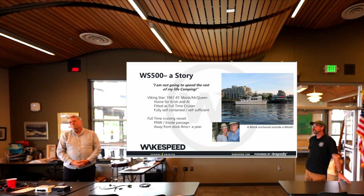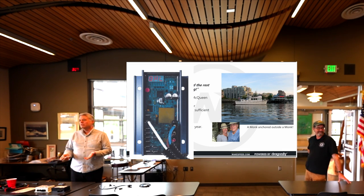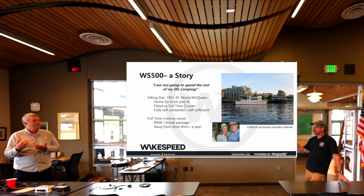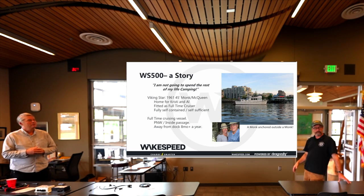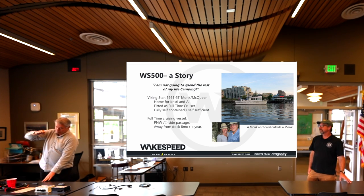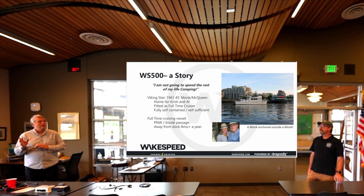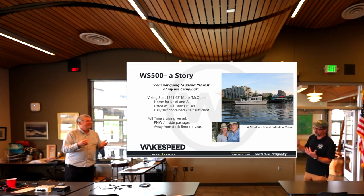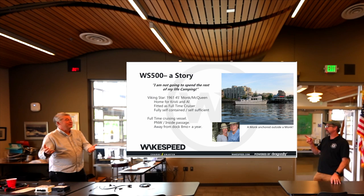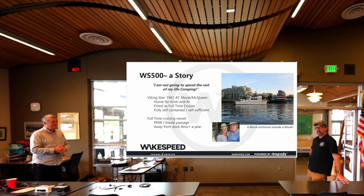On our shakedown cruise, with over 2,000 pounds of lead-acid batteries — 1,420 amp-hours of lead-acid, actually forklift batteries, six big cells — I found that no matter how much I configured the regulator, I could not get it to fully charge the batteries. It would go into float prematurely. On the Columbia River, I'd stop the boat in the middle of the river, go down into the engine compartment, pull the harness off and put it back on because I'd get an extra 15 minutes of charging. During that cruise the charging system failed, and when we got back it also failed the float test.